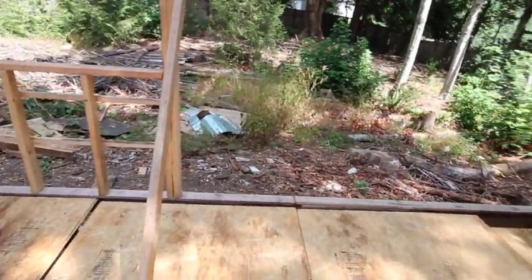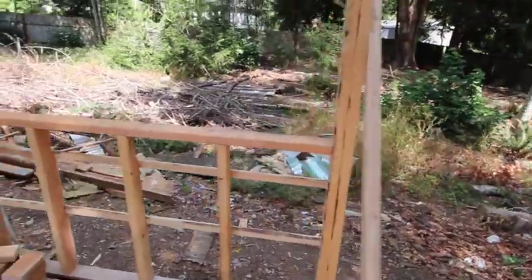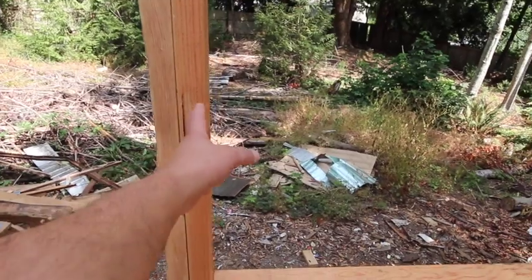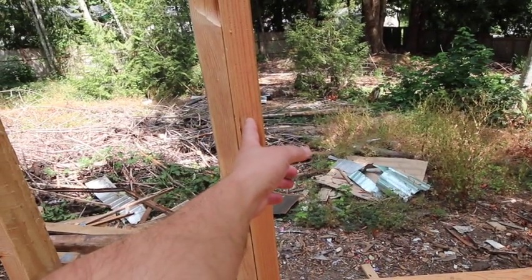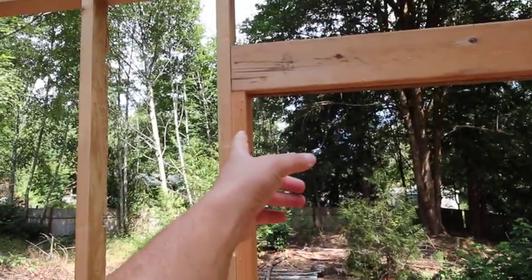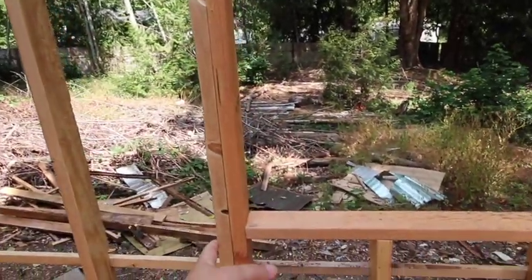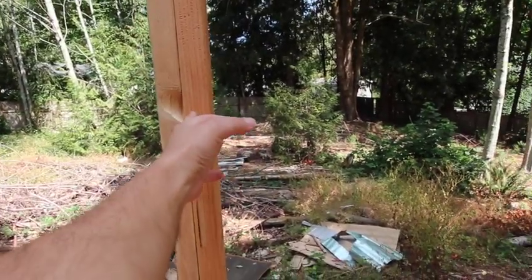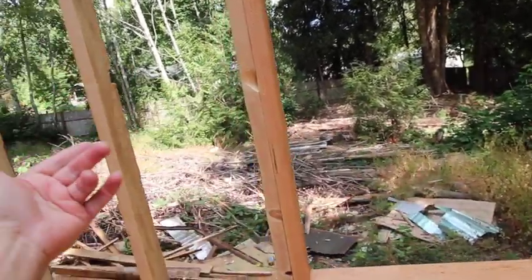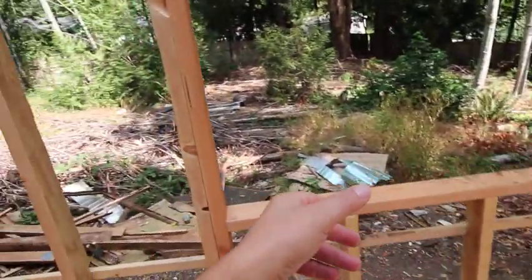We'll work on putting this wall together. Just got to do some measurements. So 16 on center here, and then what do you call these, jack stud, I believe. So all the header weight sits on there. That would be the 16 on center for the window, because the windows in the mobile homes go on 16 on centers, and so this one is 1, 2, 3, 4 spaces.